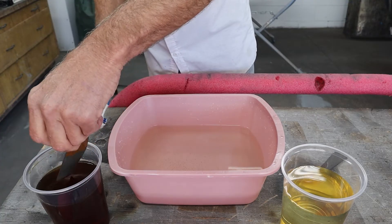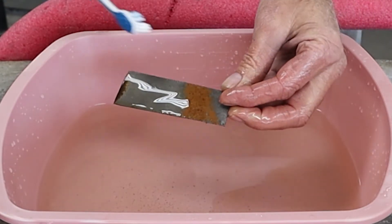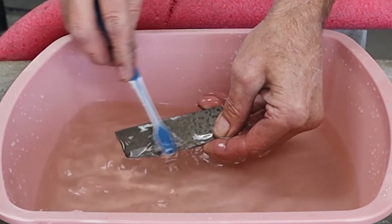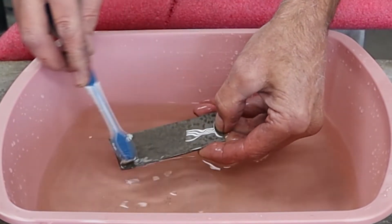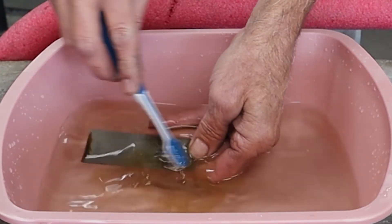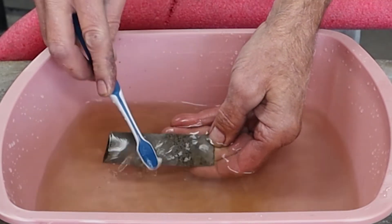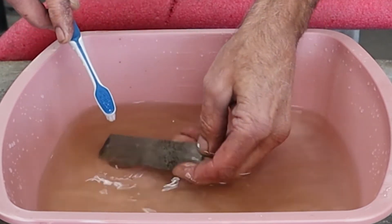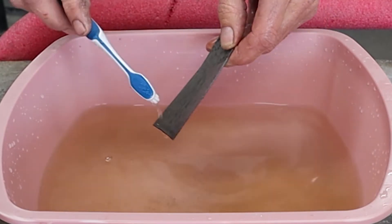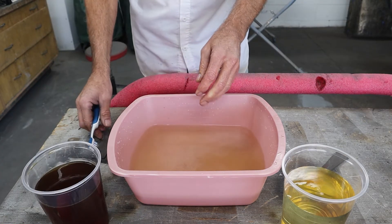The rust has just fallen off this one too. It's still got a band right there and a little at the bottom, so let's give it a little scrub. It doesn't appear that the molasses helped — it actually looks like it slowed it down a little bit. So molasses is out. We're going to stick with just the EDTA, water, and adjusting the pH.